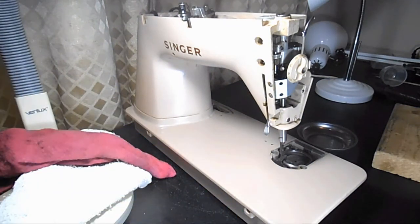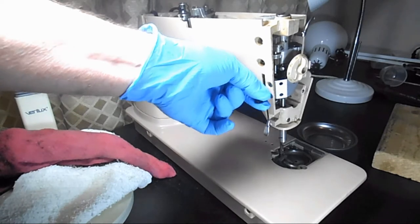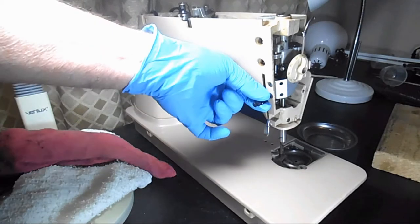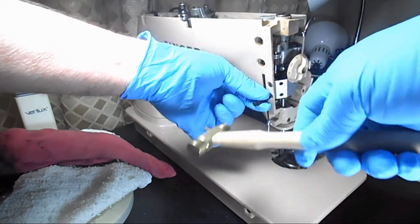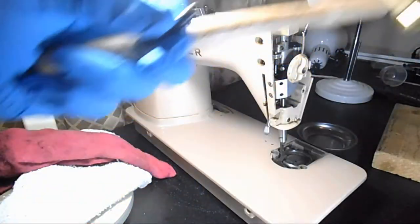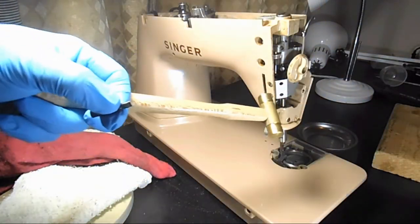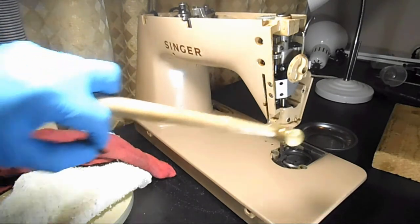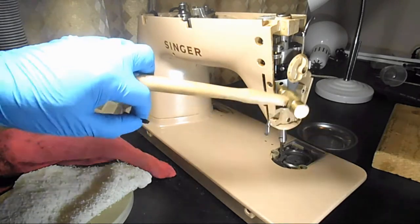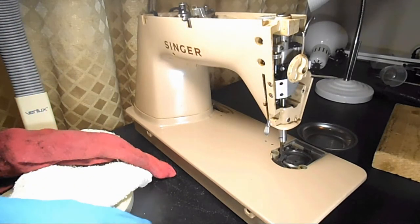What I usually do — I actually did it yesterday evening — was I took my little screwdriver bit, put it in the slot, made sure the slot was clean and my bit could get in, and tapped on it with my little hammer. I also tapped a little bit on the bracket. The reason I use this jeweler's hammer is it's brass — it's going to dent and scratch before the aluminum or steel will. That helps break free some of the varnishing on there.